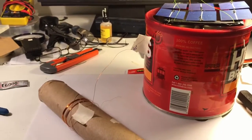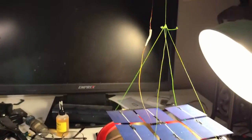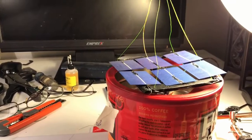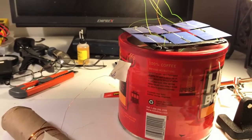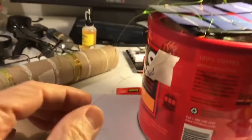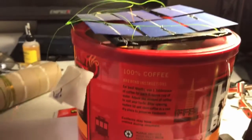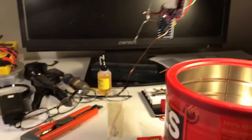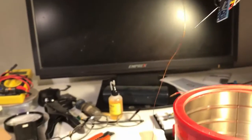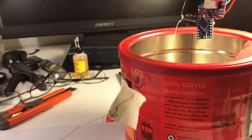Now we're ready for the last step. I have the transmitter hanging down below the solar panels, with wires connected to the top antenna and the bottom antenna. I use this to keep the solar cells safe and to transport the system out to the field and launch from there. Remember the markings were exactly 17 feet — I attached the end of the wire to the lower antenna, and you can see I still have the marking on the tape where the 17 feet ends. Now I can measure the length of the wire down to that point, go to the other end, and remove the appropriate amount to make everything work properly.